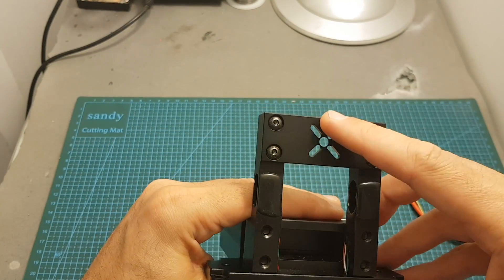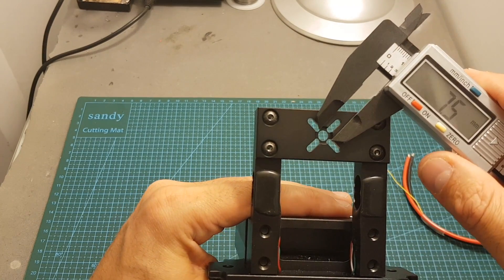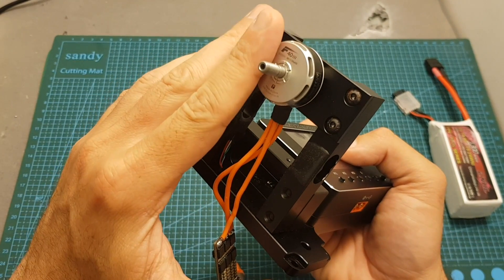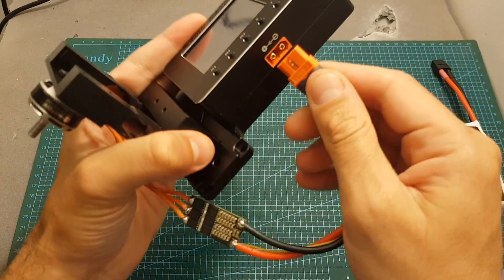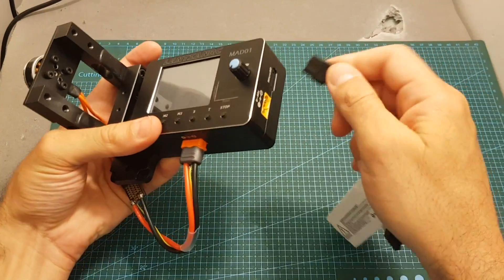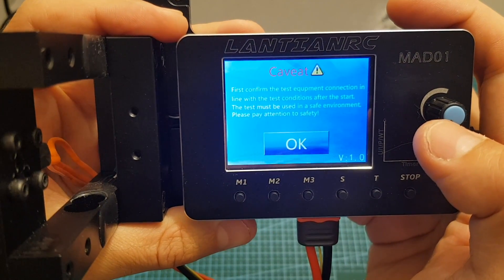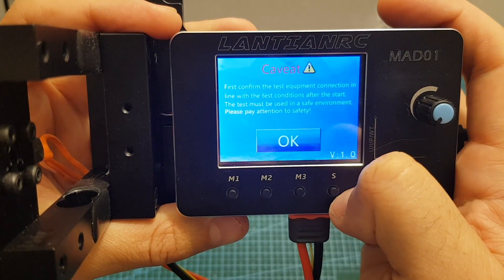On the front we have the motor mounting placement. The distance between the motor mounting holes is between 8.3 to about 20.4 millimeters. After mounting the T-Motor F40 M3 motor and soldering it to the ESC, I can plug in the XT60i connector and power up the thrust stand.